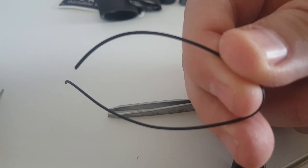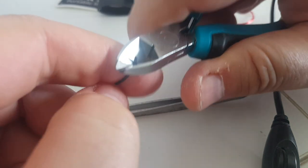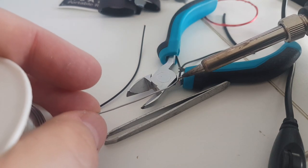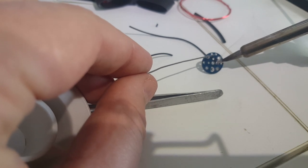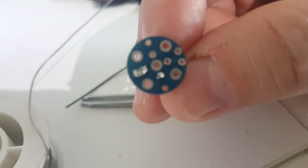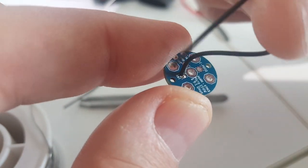Next, take this piece of wire and cut it in half, leaving one of them an inch longer. I ended up with two identical length wires, but I don't think it matters. I'm going to strip one end just a little bit, put a little bit of solder on that — not too much — and solder it into the antenna pad. You have to make sure you don't have too much solder on the wire because the hole is really, really small. That's pretty nice. There is a strain relief hole right next to it, so I'm going to thread the wire into that.